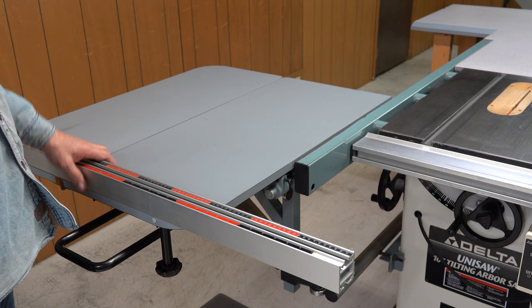That's all it is. And these help when you're doing rabbeting or doing dados to a whole bunch of different boards, and they have to be true to the fence for your rabbet where it's going to be. So it's just a safety feature. They cannot kick out once you bend this inward to get past it with a piece of wood. They get longer the other way. It can't kick out. So it's another safety feature. Real nice if you're doing dados and stuff with repetitive cuts with lots of pieces.